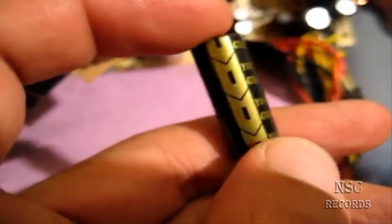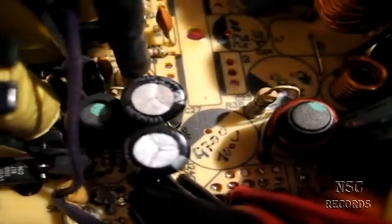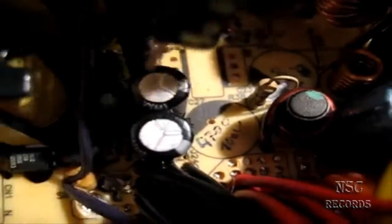The stripe sign appears here and again here. This sign means the black side - the negative side. Like most parts that have a plus and minus, this stripe indicates the negative terminal. You can see it clearly - it's the 4700µF one I've labeled. This stripe must go toward the black side of the component on the board.